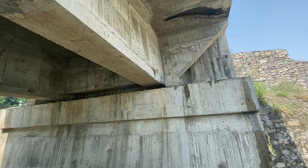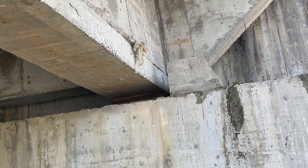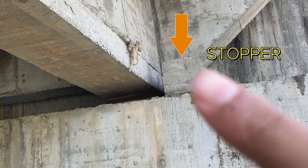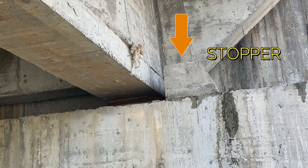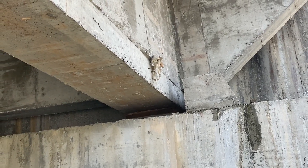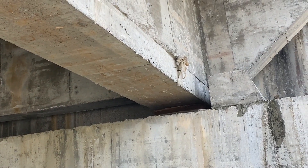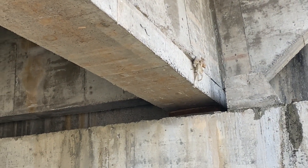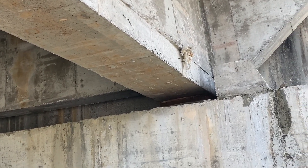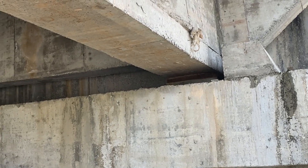On the side at the bottom of this longitudinal girder, we can see this stopper. It will help us prevent lateral displacement of the bridge due to lateral forces — such as earthquake forces, vehicle braking, or similar loads. This stopper helps restrain the bridge from lateral forces.